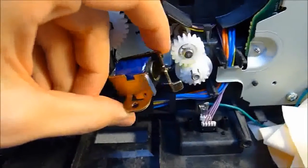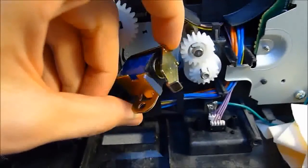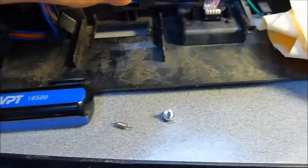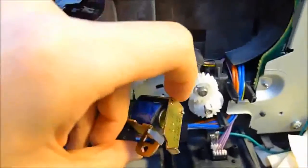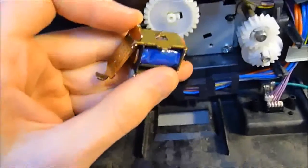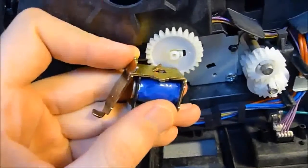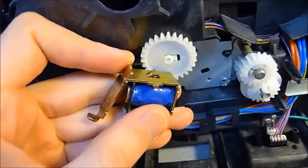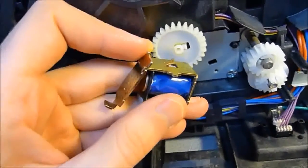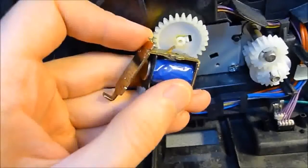Now as you can see, that's what it looks like with my little gray piece of electrical tape stuck on there. You can go ahead and put the spring and the screw back into the solenoid and hook it back in. Just be very careful when putting the spring back on — I would suggest doing it from this angle, otherwise that spring is going to act like a rubber band and shoot off into far corners of your office, which has already happened to me twice. So just be careful when hooking that back on.